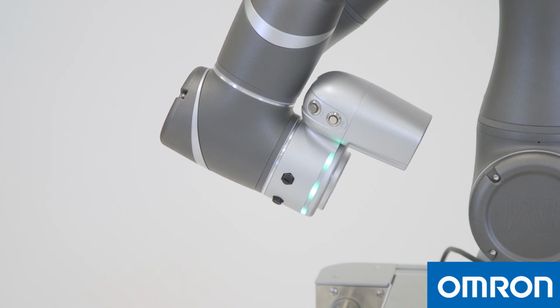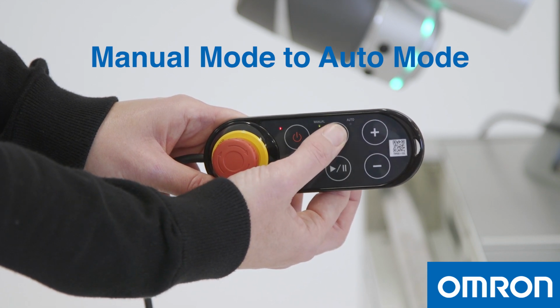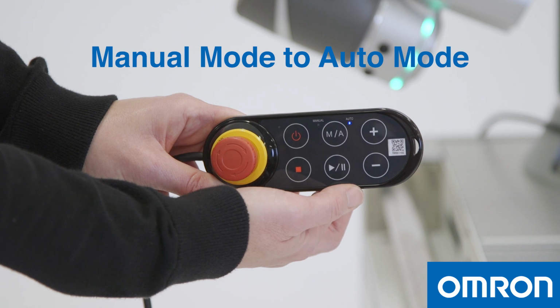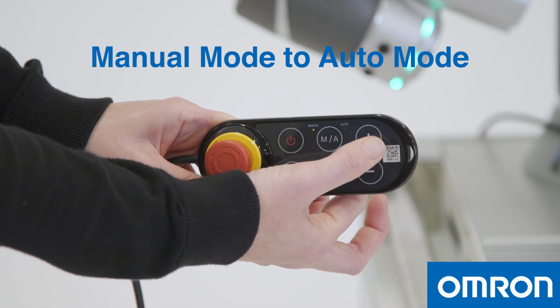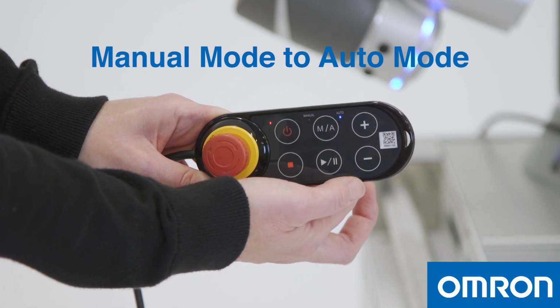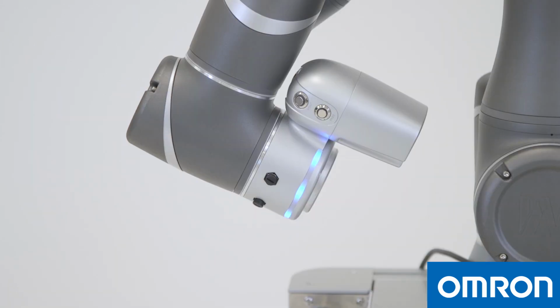in manual mode. To change from manual mode to auto mode, press and hold the M/A button until you hear a beep. Release the button and you'll see the indication light start to blink. The M/A light on the robot stick will start flashing, then press plus minus plus plus minus in sequential order. Now you are in auto mode. In auto mode, the light ring will be blue, and you can only run the program as it has been set. You will be using auto mode when the Cobot is in actual operation. When the robot is in auto mode during non-collaborative operation, the light ring will flash between purple and blue.